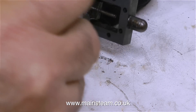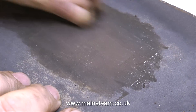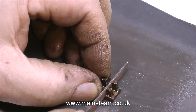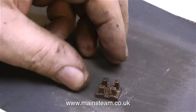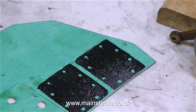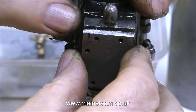It's a definite crack — and I don't mean the thread that's broken through the crossbar that drives the valve; I'll just make a new one of those. I'll carry on and remove the rest of the mess from inside the steam chest and give the valve a good clean-up as well. The only problem I can see with the valve is that it's a little bit tight on the crossbar, so I gave it a light rub with a needle file. I'm actually going to make a new crossbar to drive this valve. I'm also making a couple of gaskets, using the steam chest cover as a template. And as the steam chest itself is cracked, I'm going to make a new one anyway.